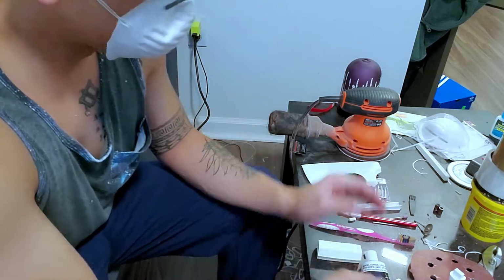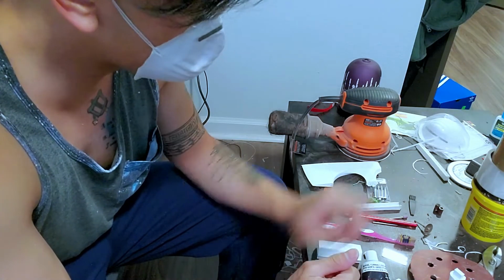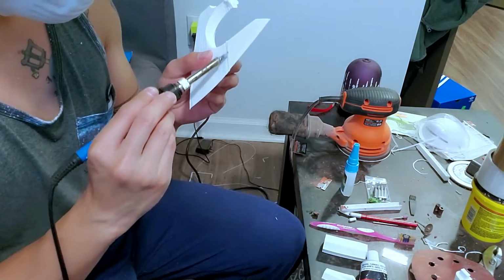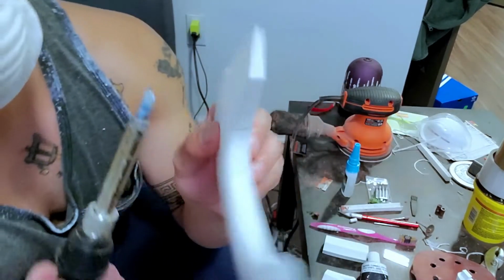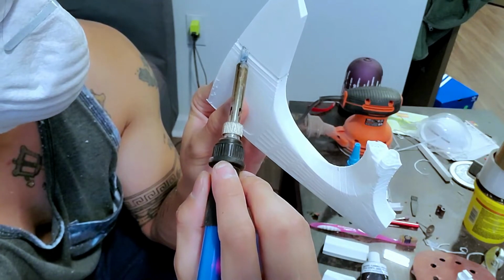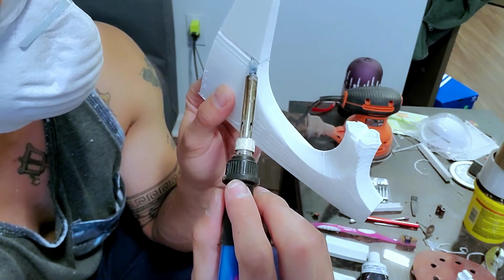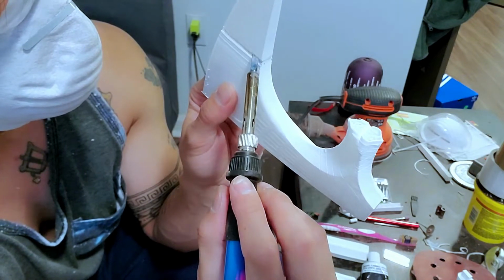Okay, so now that all of the brims have been removed, we can start gluing the pieces together and welding them. When I'm doing this, all I'm really doing is fusing the seams together so that the plastic from both ends is overlapping each other. I'm not really making any deep cuts. I'm trying to join the surface of the plastics together.